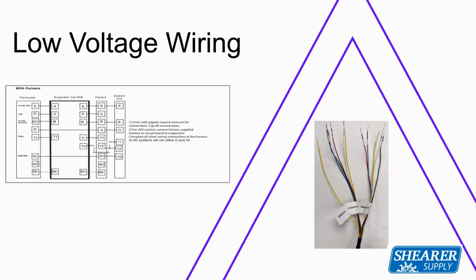Now, if you're going to do dual fuel, you may want to get yourself a control that has outdoor temperature sensing capability, so that you may have a turnover point for that unit. Now, it will go cooler in temperatures and still maintain capacity, but you're still going to want to find out what that break point is so that you can bring on the supplemental heat with it by possibly using a thermostat with an outdoor sensor on it.